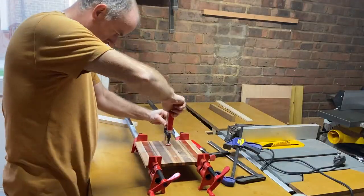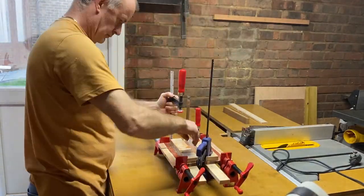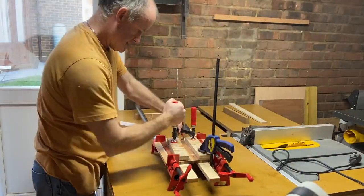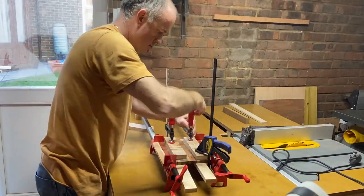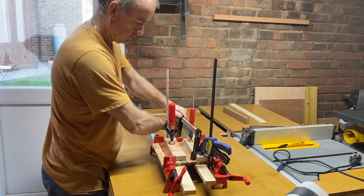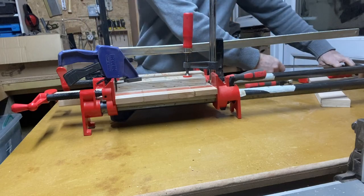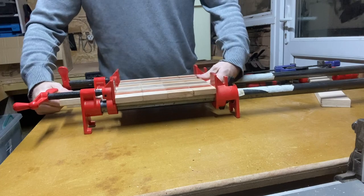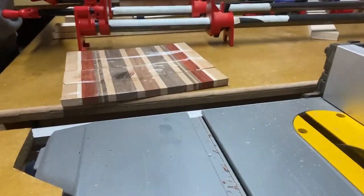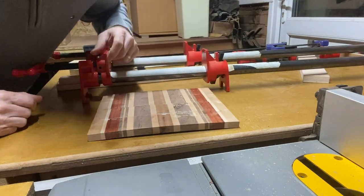The glue is just not curing because of the temperature outside, and inside my workshop it's pretty much the same. Three of the joints glued up and didn't come apart, but just that one failed. So I cleaned it up and re-glued it, chancing my luck again. I left it in the clamps for about a week over the Christmas period — but when I came back there's a bit of a bow on the wood now, which is another problem to deal with.